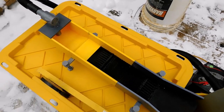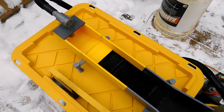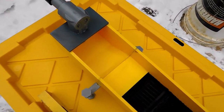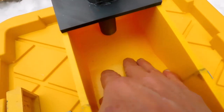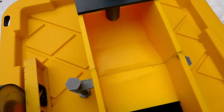Let me walk you through it and my thinking. One of the reasons I made it is I wanted something to run a small amount of material without having to set up my whole sluice box — something I could run into a five-gallon bucket with only one five-gallon bucket of water. This is off of Utah Avalanche's design. He's made a lot of his sluices off this deep well right here, which gives it a really smooth water flow. You can see how the water comes down in the back, makes a rise, climbs up across this plate, and then directly onto the mat. Utah Avalanche makes all his with wood, so I just 3D printed this — I want to give him credit for that.